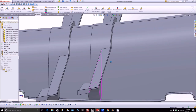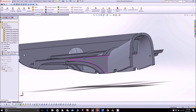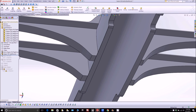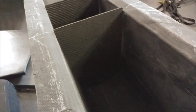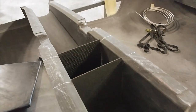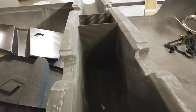We're heading towards getting the seat mounts done. The next thing we needed to do is create some stiffener walls in the middle of the keel here, just to stop any compressive forces squashing the walls of the keel — because the seats are cantilevered, and when we ran the FEA they needed a little more support. These will be bonded in place with a hole cut out so we can run the controls through them. Jeff cut those out of the carbon fiber flat stock we laid up a while ago.